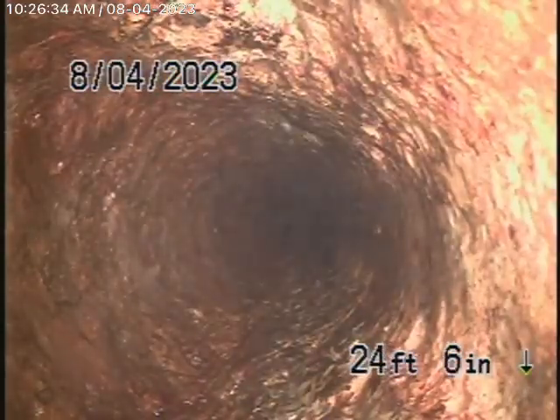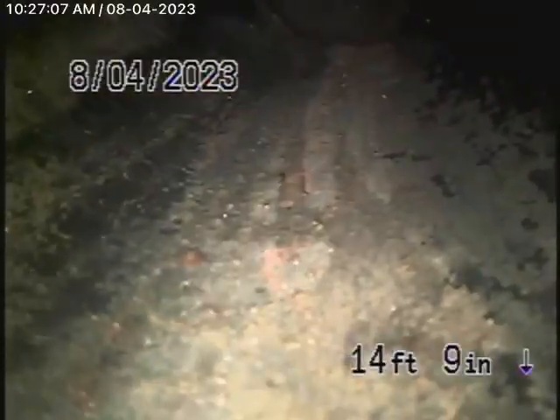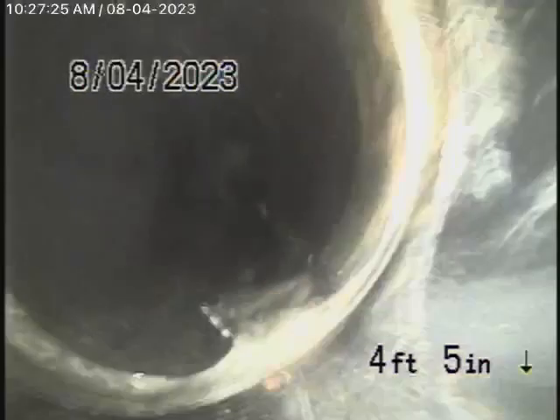A clean-out should be installed on the outside. I think it would definitely be a good idea to repair the break in the pipe below the electrical meters, and then hydrojet the sewer line very carefully — you don't want to put too much pressure on the cast iron because you don't want to break it, so it would have to be hydrojetted very carefully. Underneath the house it comes back to ABS plastic, which was obviously replaced at some stage. This all looks good — it comes out of the clean-out in the little parking space where they park their cars.